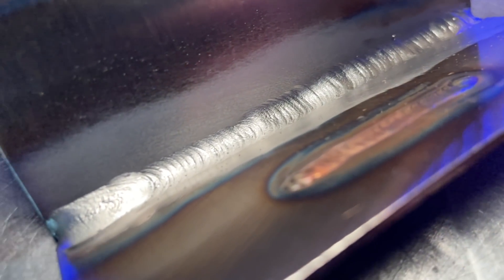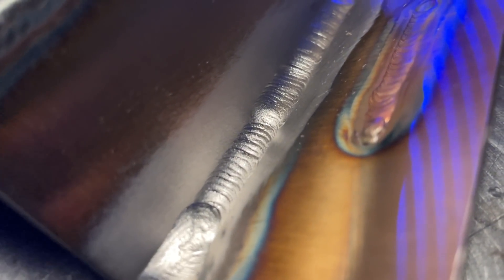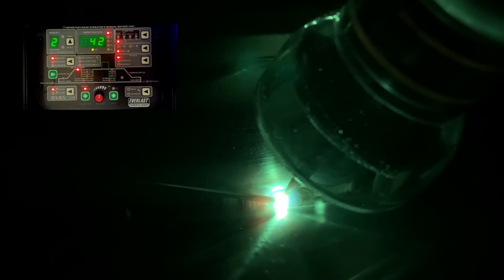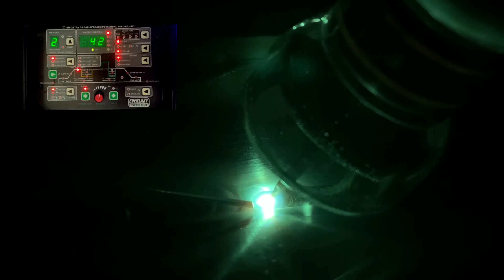This pass has gotten a little bit big, so we're going to have to do our makeup pass about as big as this one or bigger. Our main goal is not to overheat the base material any more than it already has been. What I'm doing on this pass is running over the existing pass, making sure I follow a consistent width and keeping everything as straight as I can. I'll also be adding a small amount of filler material on top, which is going to help reduce the heat input into the base material. Using filler material will always help reduce the overall heat input.